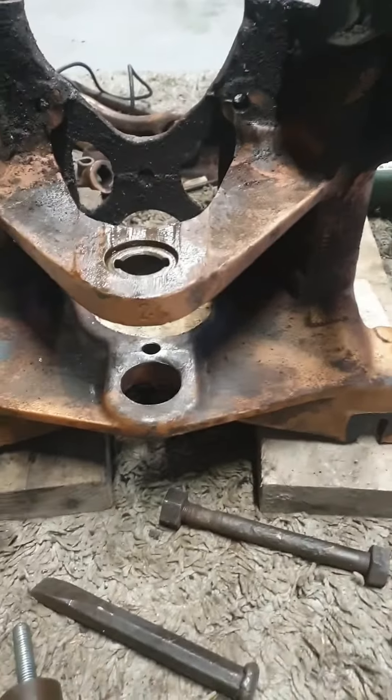I managed to cut out the cross beam with an angle grinder and what I'm left with is one bit of the centre pivot pin that's nearly tapping out. This other bit does not want to go down this way, so I'm going to have to maybe turn it around the other way. So this was quite a challenge.